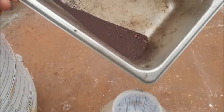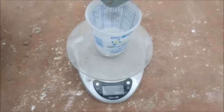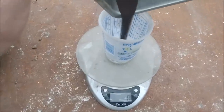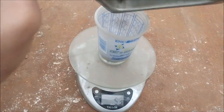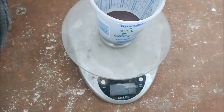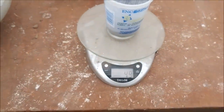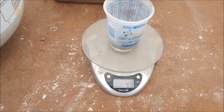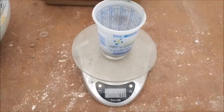Alright, here's our little scale. We've got our oxides now, our roasted sulfides. We end up with 49 grams of roasted oxides. So I'll get a slag recipe together, let you guys know what it is, and we'll mix it all together and get it smelted.